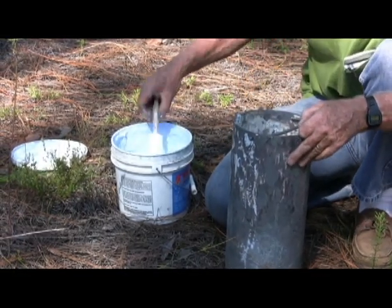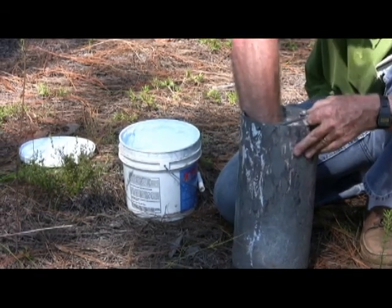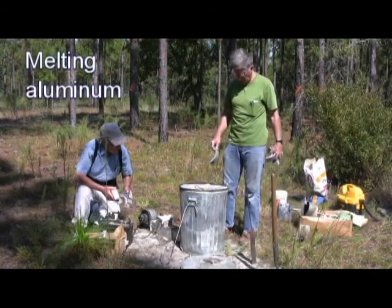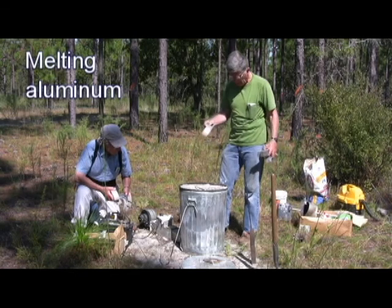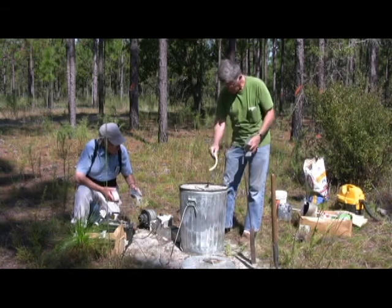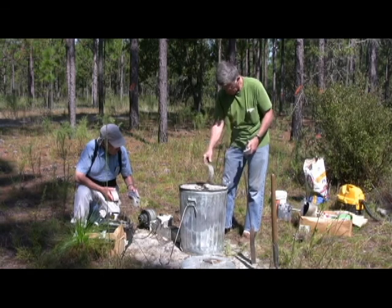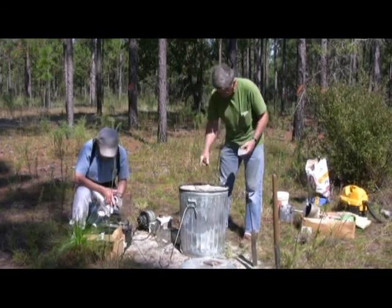The crucible must be re-coated with every use. The crucible's coated and the coating is dry now, having been heated. Now we're going to add the aluminum — a lot of aluminum, because we're trying to melt the full seven liters. So we just fill it up.